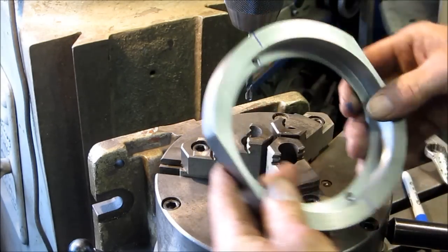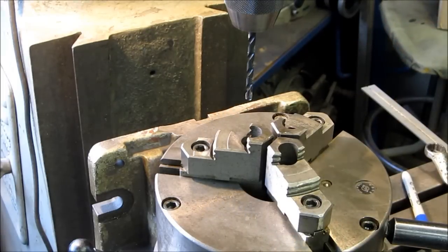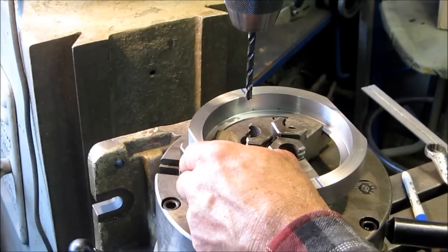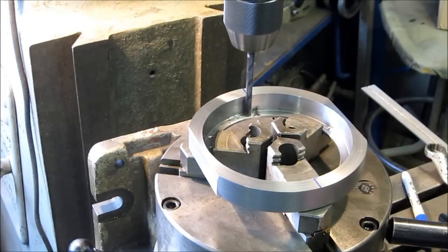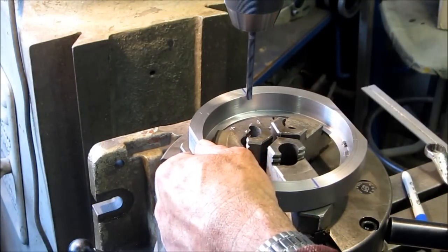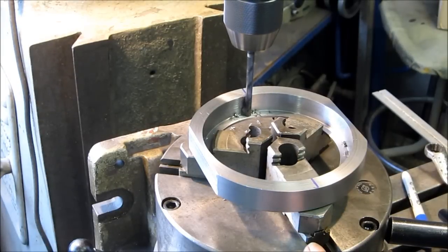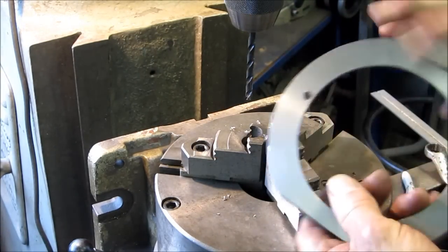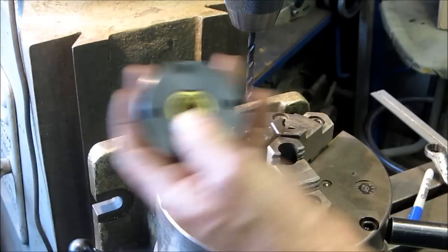While we have this set up, we're putting in two holes to knock out the old bearing if it ever needs to be replaced. We'll drill in punch holes so we can punch the bearing race back out of its register if need be. These don't have to be timed — just use the V on the square and draw a couple of sharpie marks to locate them. Now we'll dress those up, turn our slugs, pick up center, and then we'll be able to put the holes in for our lead nut flanges.